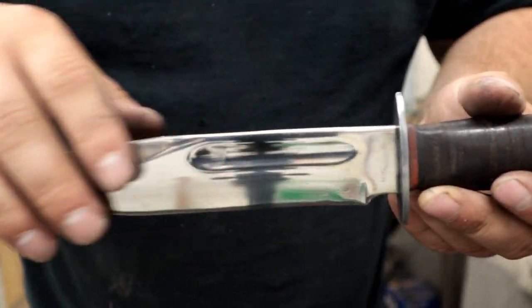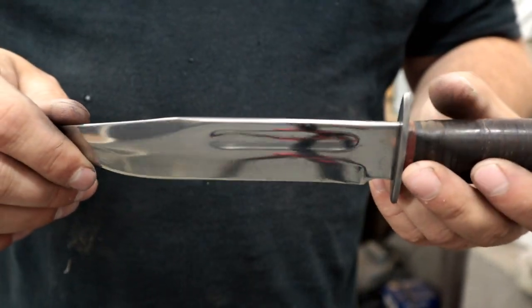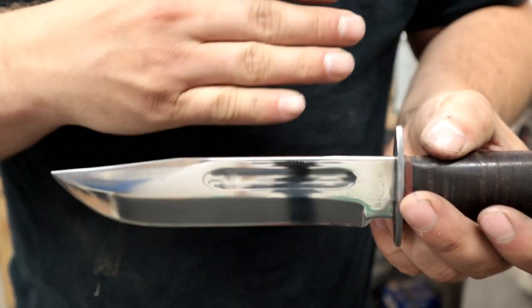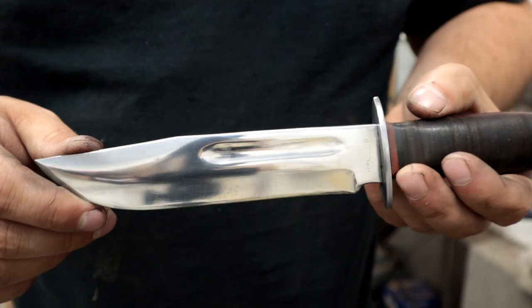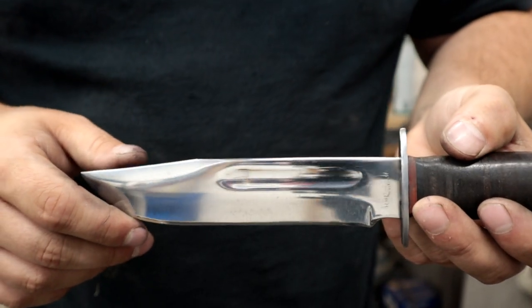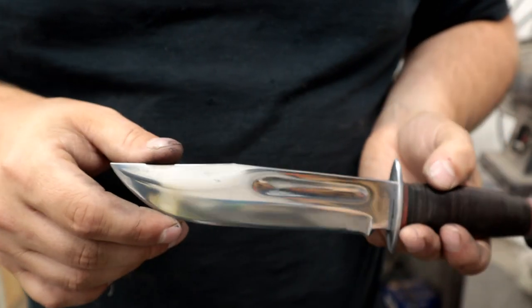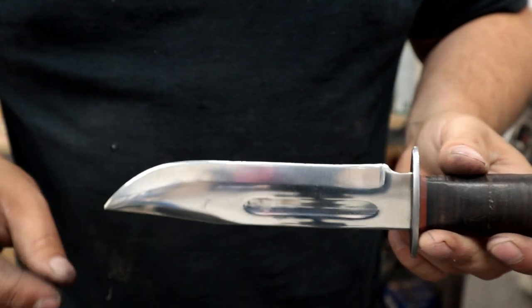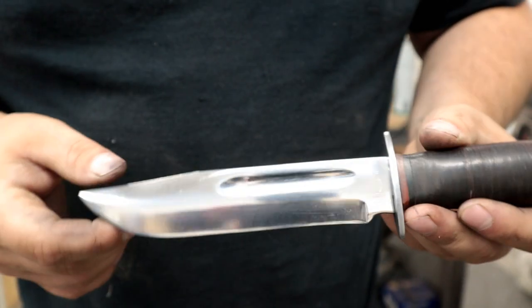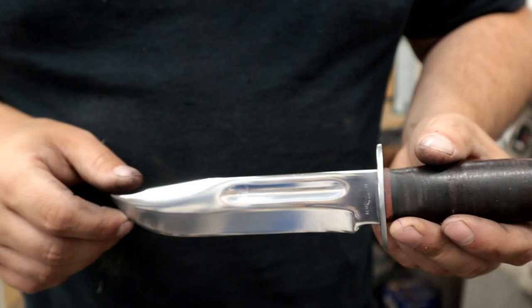But there is a strong haze in here, and you can only really see it if I had this exact blade placed right here that had the final polish. We'll go ahead and take this up a notch right now, and I'll see if I can match up the clips so I can go half screen and half screen, so you can see what it's like. We'll go to one of the softer wheels. We'll switch to a finer compound, the rouge. And you'll see the difference, hopefully, in the clarity of this polish.